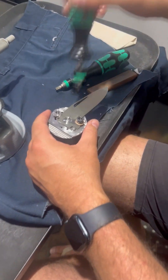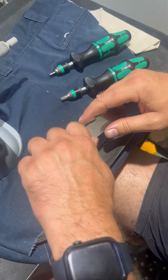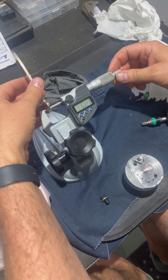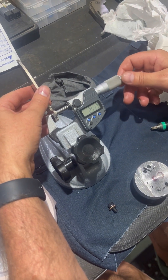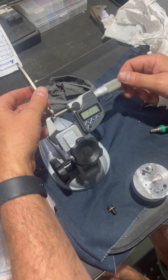Boom, this one has been finished. We are aiming for a 2.205 thickness and hoping for a symmetry of at least plus or minus 10 microns. Measurements are: 2.202 and 2.206.